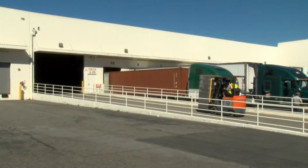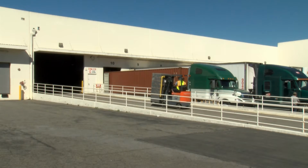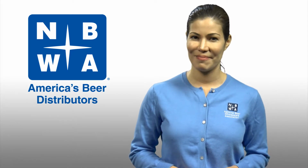On ramps or inclines greater than 10%, operate with the drive wheels upgrade, whether going down or up. The drive wheels are the wheels with brakes and must be kept on the uphill side. Now make sure you know where the drive wheels are on your specific truck.